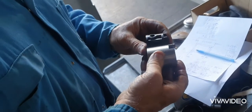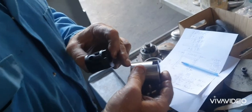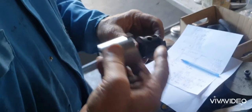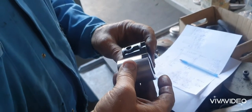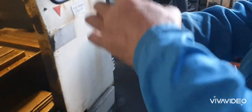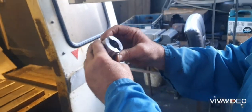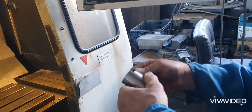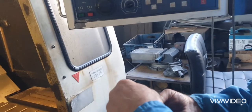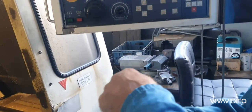these holes, we've got to work out where these holes are. How far from there? I'll just measure it. What we've got to do, we've got to hold that in a vise, and we'll have to put an end mill right through. Now that should be in the centre, so we'd have to clock that 0-0 and put a tool there and come across the same way